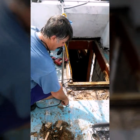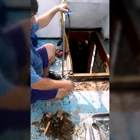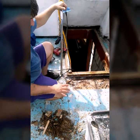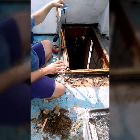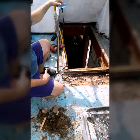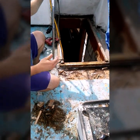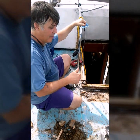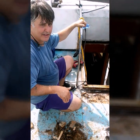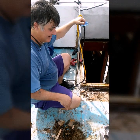Then you come back in on all these lines I have cut — you just sand back the area around it. I'm going to be sanding this whole deck off anyway, so I'll sand it back a good bit into the fiberglass — about a sixteenth to an eighth of an inch in spots. Where the cuts themselves are, I'll cut it down like a V, kind of rounded out. Then I'll go back and pack fiberglass in those areas and epoxy-glass into there to make sure I get a good bond.